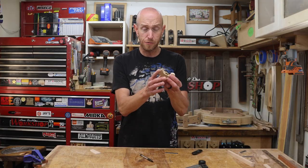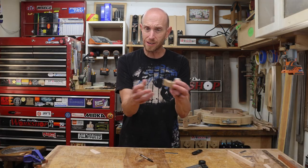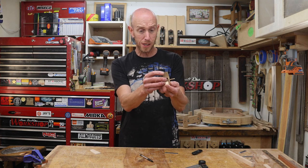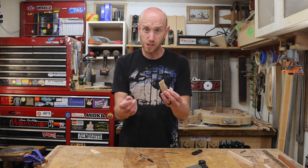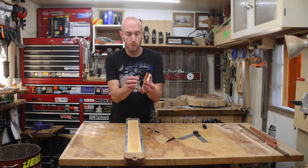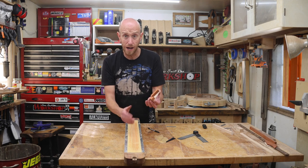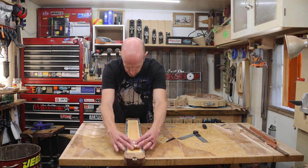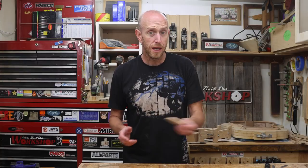I'm using wood glue here, but I don't think that's absolutely necessary — there's no reason you couldn't use CA glue, which dries super quick and you can have the plane knocked out in a matter of minutes. In fact, the first mock-ups I made of these planes were made with CA glue, and I see no reason why they couldn't be completed pieces. Use whatever glue works for you. Just to make sure both surfaces are parallel, I'm going to run them on this sanding beam real quick — just to make sure it's nice and flat and everything's even.